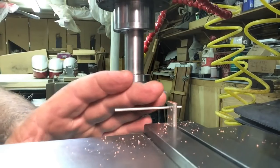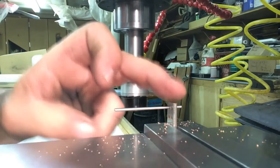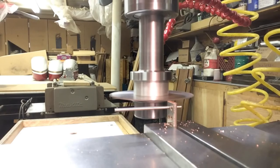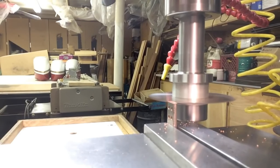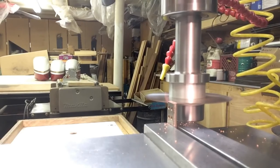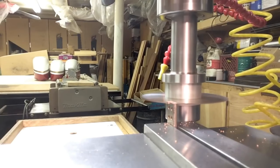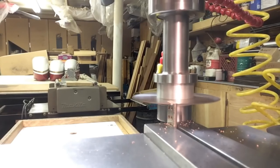This project is a small copper bus bar piece. It's silver coated — half an inch wide by a hundred and thirty thousandths thick. I have a gauge pin in here, this is a point zero eight one in the hole. I've measured from the top to the top of the pin and calculated from the center of the hole to the top — I'm a hundred and fifty nine thousandths. I want that to be one hundred thousandths.